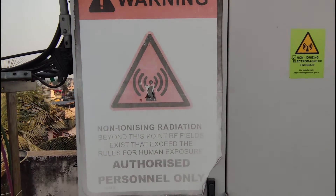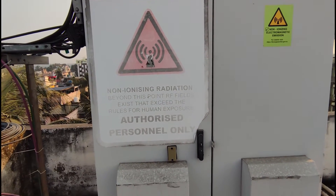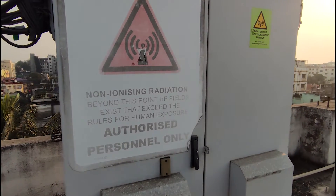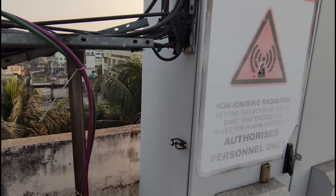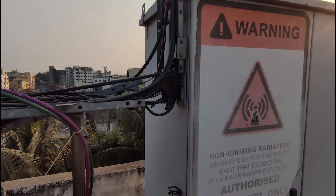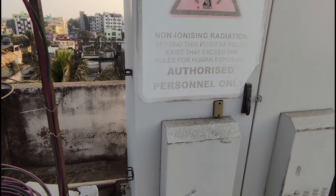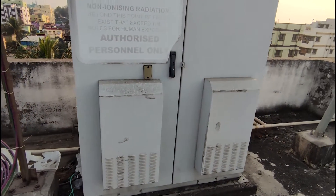This CDU will have three sets of optical fiber cables coming from the three sectors — alpha, beta, and gamma — completely BRG color coded as we discussed in the previous video. The unit will probably be Samsung's CDU 30, but I can't be completely sure about it. The CDU is connected to the RRH through CPRI and it can provide up to four carriers per three sector service.